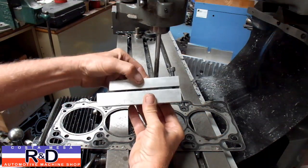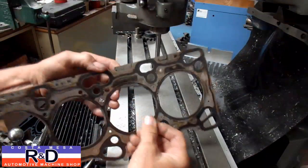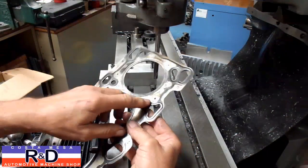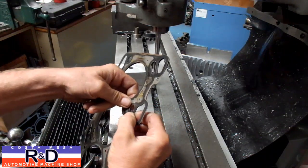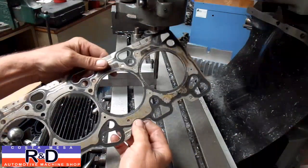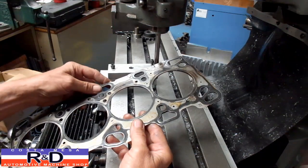The reason that we need this is we need to clamp the gasket firmly between these two pieces of metal. If you take a reamer and try to ream this without the fixture — say you just bring it down like this and try to ream the thing through — you're going to wind up tearing out the gasket material, and so when you go to compress the gasket, it's going to be awfully thick. We tried to do that on one of these holes just as a sample to show you for this video, and as you can see in the insert, it left a little bit of a lip up here, and that's not good.